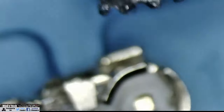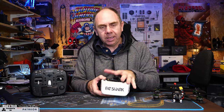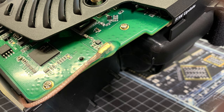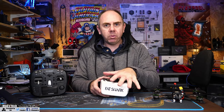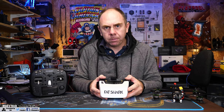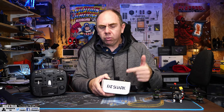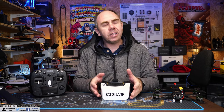After doing a repair on the connector — bending the pin straight again and reconnecting it properly — it is now working correctly. The antenna inputs are showing 100% correctly and the goggles appear to be working as I would expect. As part of the reassembly I also added a little bit of hot glue onto those connectors on either side, because those UFLs are very easy to come loose. I am concerned that over time, if these goggles are thrown around a bit, you could find your own connector come loose — so it is worth keeping an eye on that diagnostic screen inside to check that your antennas are behaving as expected. You want to make sure that the front two are behaving the same and the external two are behaving the same.